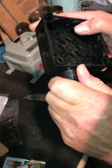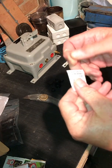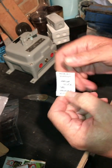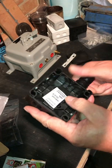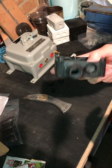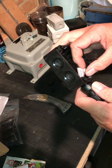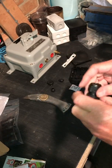Another option you can do is use these silica desiccants. I buy them from RS — they're cheap. Stick them in your box, stick your vent gland on there as well, and that will give you a nice dry box. The air circulation will go through and the desiccant will take any moisture out for as long as it survives. They work very nicely.